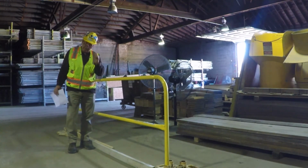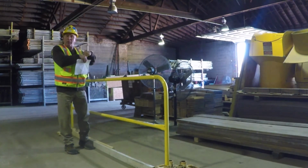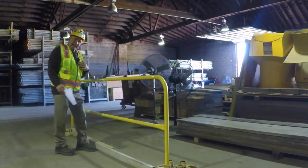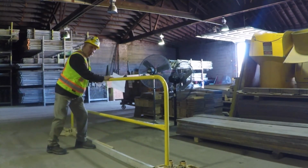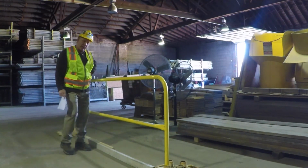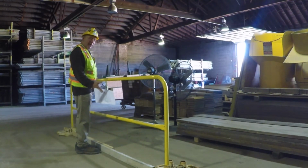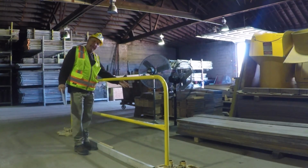Here's a best practice. Have you ever seen anybody take a guardrail down on your projects to offload a product on your floors? Because when they take this down and they put it back up, do they know what they're doing? Did they put it back up properly? I, as a best practice, walk our job sites and I give it a little bit of a push. I want to see if it's going to really withstand 200 pounds of outward force. And I'm doing a visual inspection on these guardrail systems because this is an engineering control that says Tony Baca doesn't have to tie off on this leading edge because I've installed an engineered system in front of me that will withstand 200 pounds of outward force so that I don't fall off that leading edge.